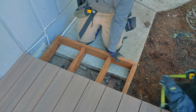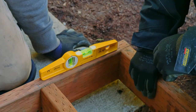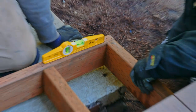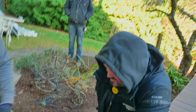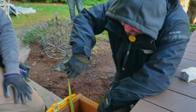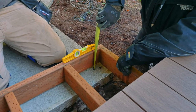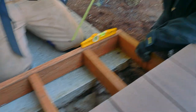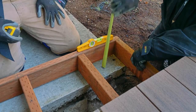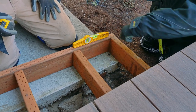So I want to raise this up — that's why I had you cut it four and a half. Both sides need to be off. I want everything off the ground, so we're three quarters of an inch down here. If we do a quarter-inch shim there, and a half-inch and an inch shim here — if we add a quarter to that we have to add a quarter here — so we do a piece of AZEK right here.